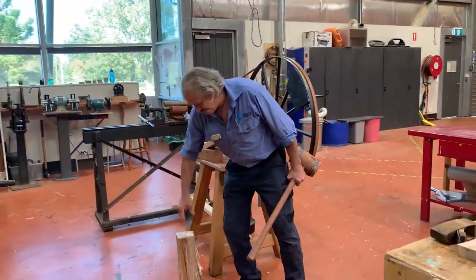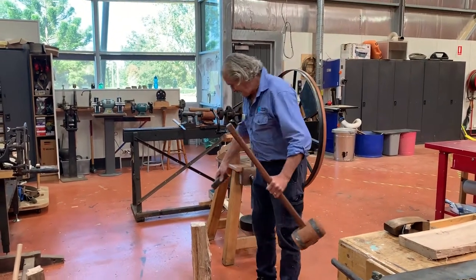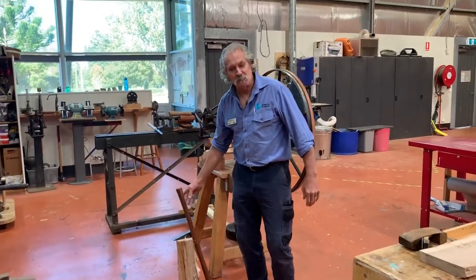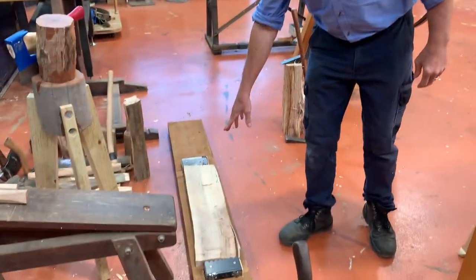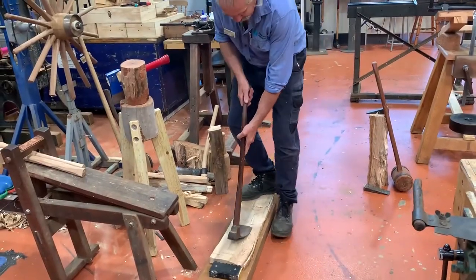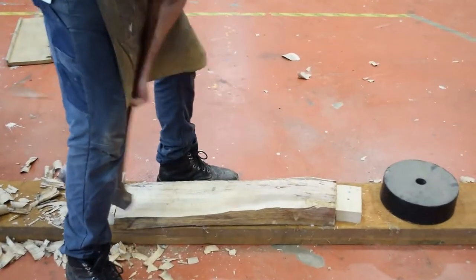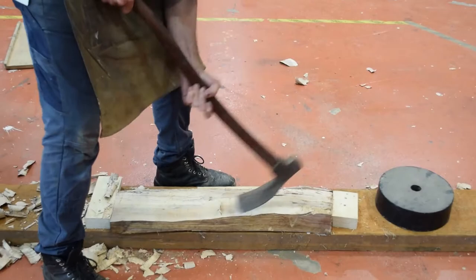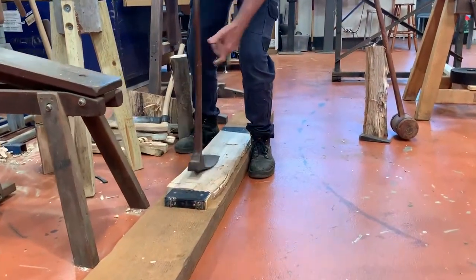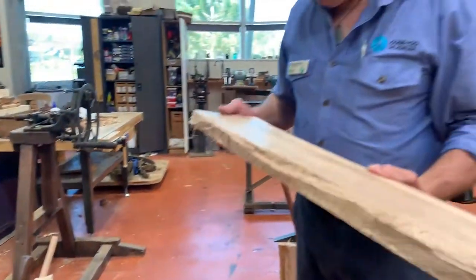Splitting up these sections, we've used wedges and a large mallet which I've made, and from there I can break out various sized boards. The next stage is to put the board down and use an adze. The split wood is fairly rough — very splintery in fact with this timber — but I've managed to pare it down with the adze and come up with this finish here.